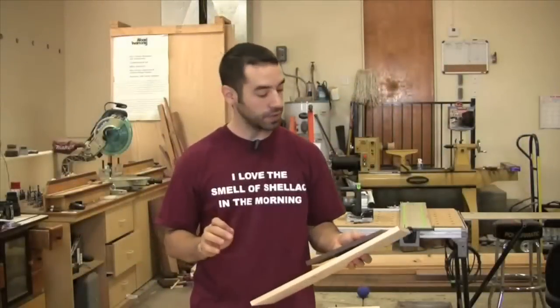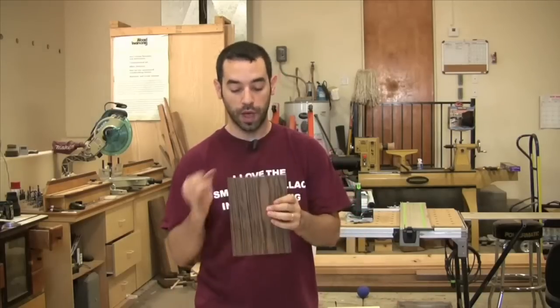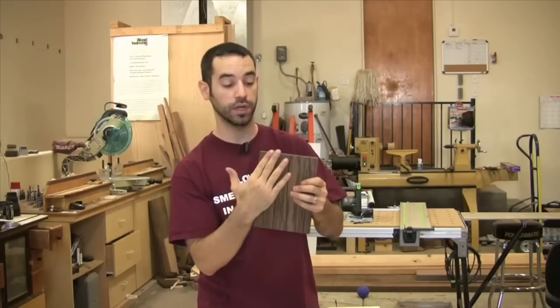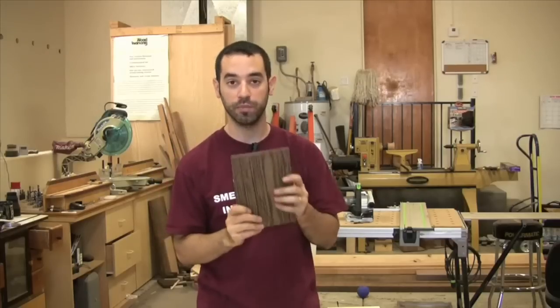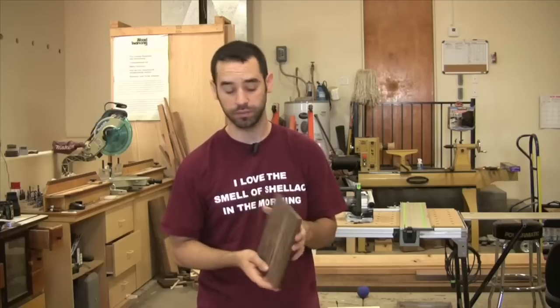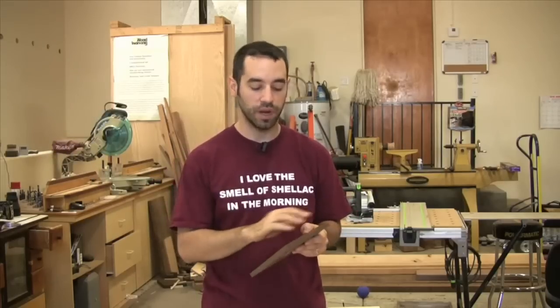And one thing you're always gonna have to contend with when you're cutting dovetails is the war on tear out. When you're routing through boards like this, the grain, which is running vertically, can very easily just crack and bend down. So this can be a very big problem, especially on splintery, nasty woods like Wenge. It's a real problem. So what I usually do to combat that, I've got a few tricks and I'll show you those in a bit on the jig itself, but to sort of stack the cards in my favor, it'd be nice if I could do something at this stage to prepare this piece.